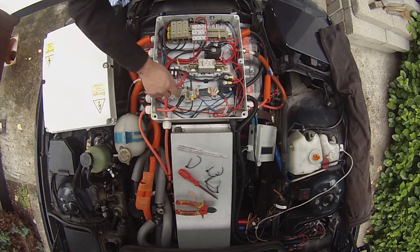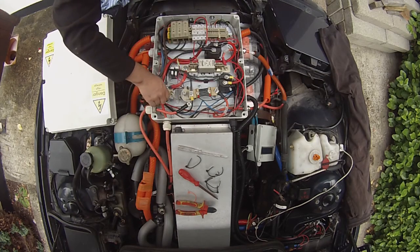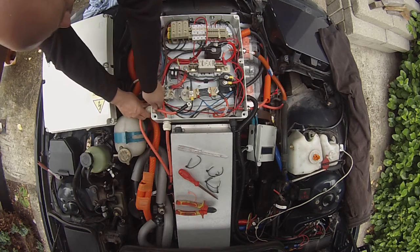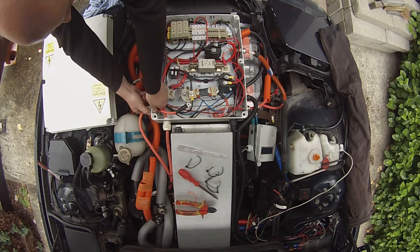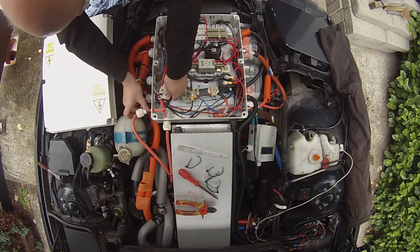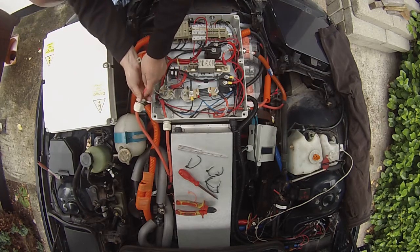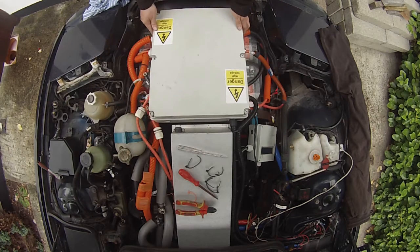These are quite simple — you've got two 13 millimeter studs there to remove. To simplify removing these cables, I'm going to take them off with the gland. I'm going to take the lock nut off the gland on the back, then move the cable along with the gland. Now, to keep everything safe, pop the lid back onto that box.